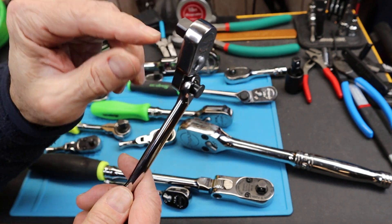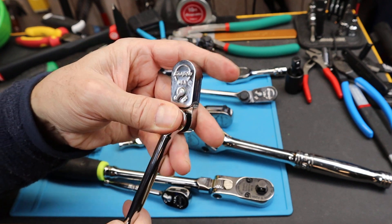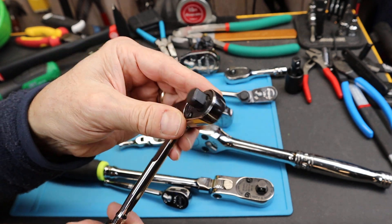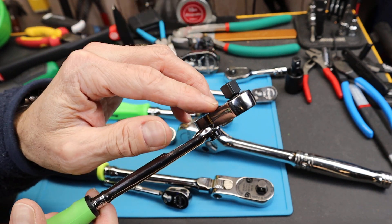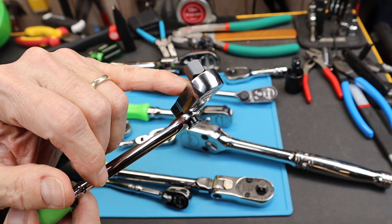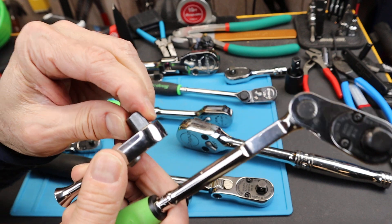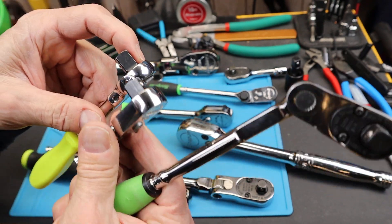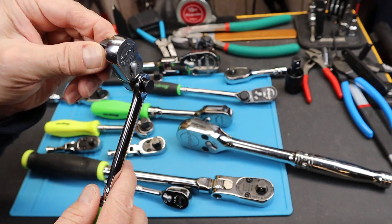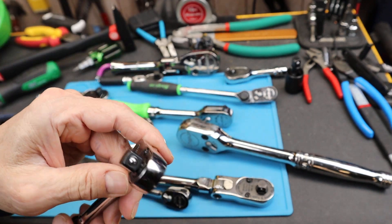When you go to the website listing for what to do with this small-head version — crickets. It's not going to say all those things because it's probably not designed for that. Instead, what it's designed for is when you need a much smaller, more nimble head on a 3/8 ratchet without the upper end in strength. So there's a deliberate shear point so it's a lot easier to fix that than if you mess up the whole ratchet.